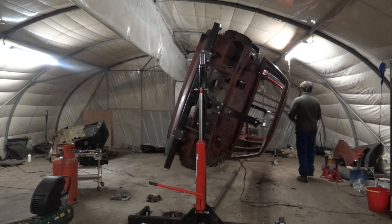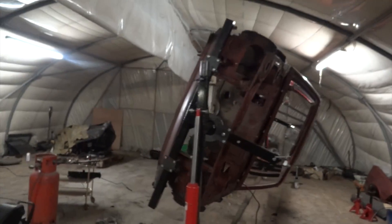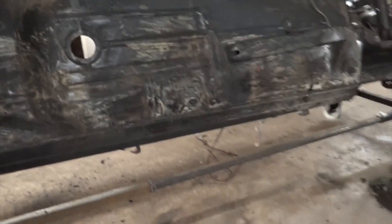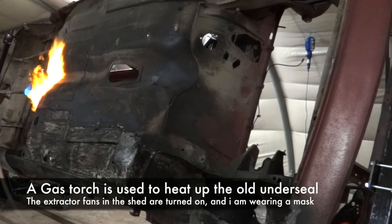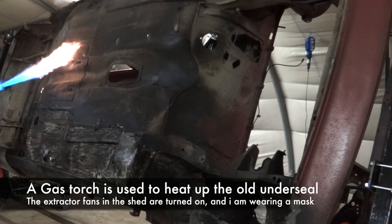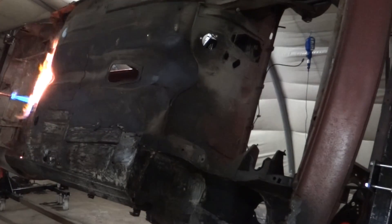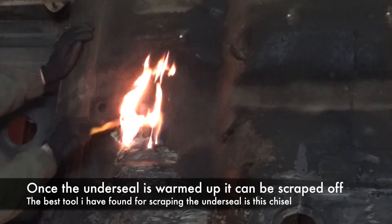Do you see them on the back? At the moment the car is not at the right angle to work on — I was working on it last night. So far I have stripped the underseal from this lower part of the floor. That is the passenger side, just the other side to continue. I'm sealing each section done and then it should be ready to get sand blasted. I'll just give a quick demonstration of the way I am burning the underseal on the car.